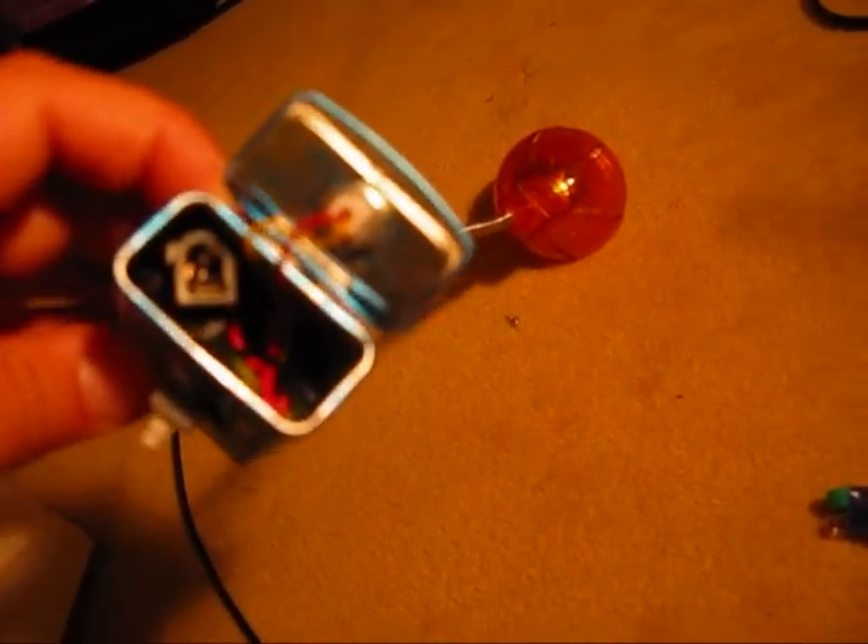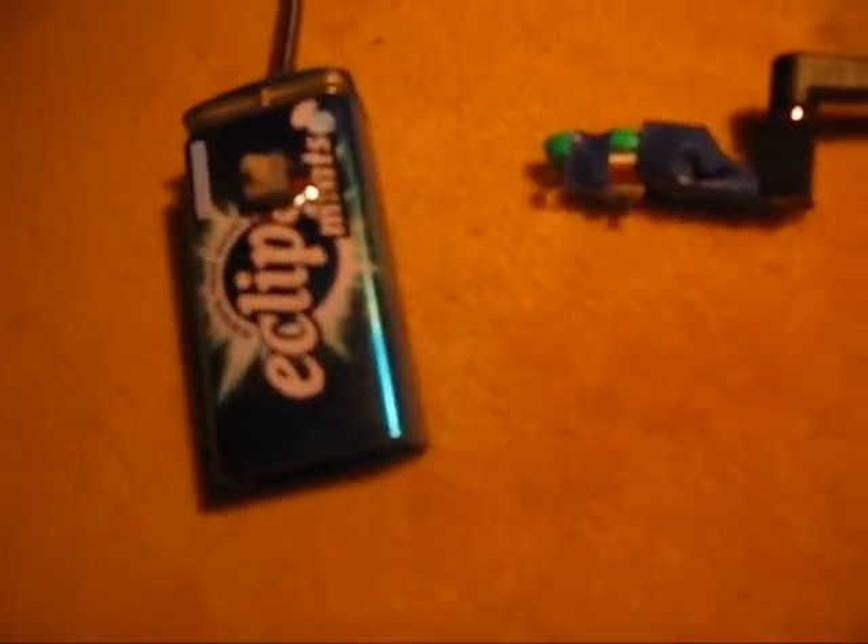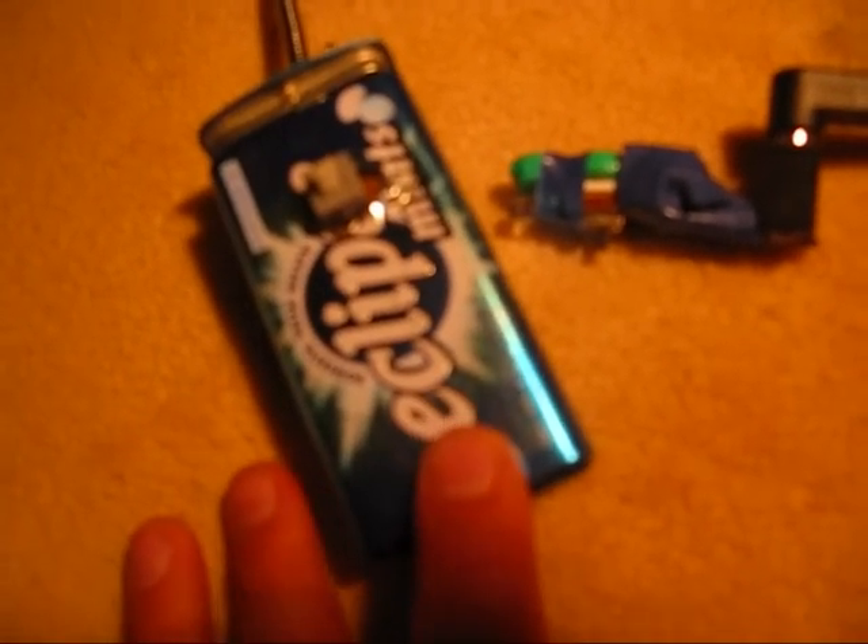This is a 600 milliamp battery that's inside here at the bottom — if you look down there's a green sort of cartridge, that is the battery: 3 cell, 3.6 volt, 600 milliamp. The 240 ohm resistor only allows about 50 milliamps to be pumped through it. So if this is a 600 milliamp hour battery, it's going to take quite a while to charge. This one on the other hand will take only about an hour to charge, and it is brilliant.